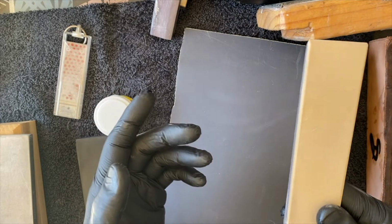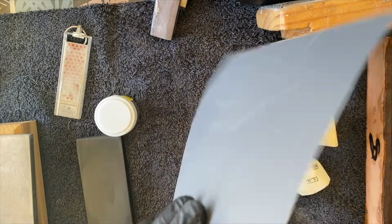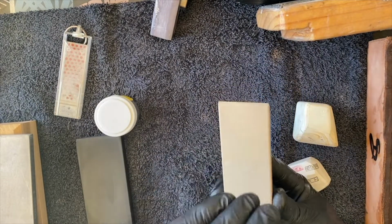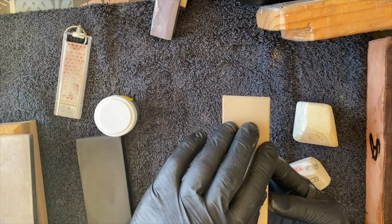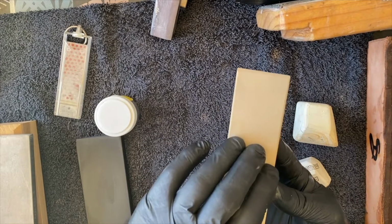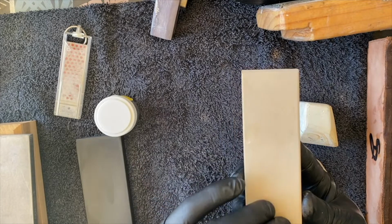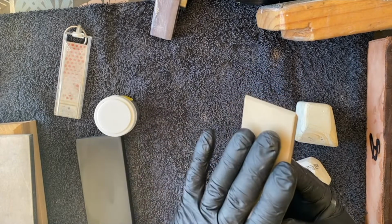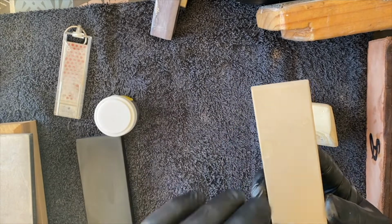But if you're looking at this video, I think those basics you already understand. So back to a coticle. A coticle's nature you can change by the slurry of it. So I can make one stone cut all the way from, let's say, 2K, maybe not 1K, 2K, all the way to 8K and even above. And that is by just changing pressure, the way I dress the surface, the lubricant I use on it, and so forth. That determines that outcome.